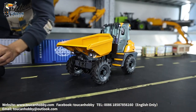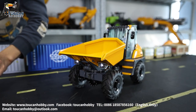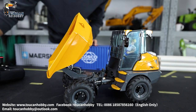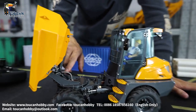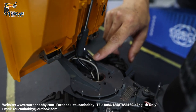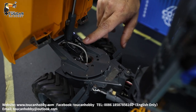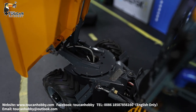For the hydraulic, start the pump and lift up the bucket. After lifting, you can see here we have one switch. When pressing, the bucket is down — you cannot make the turning of this bucket. So, after lifting up only a little, you will be able to make the turning of the bucket.